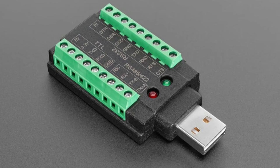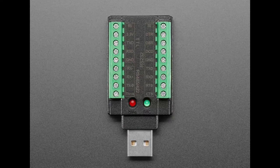And then at the bottom left is the RS485, and that uses a MAX485 converter chip to convert the RX and TX into differential signals. Those are good for long distance signaling. I think DMX also uses RS485. So altogether, you can pick and choose. If you want plus or minus 8 volt, use the RS232. Want TTL level, use the TTL level. You need to talk to 485, use the 485.